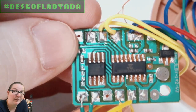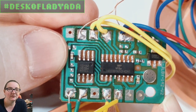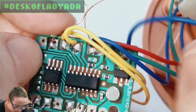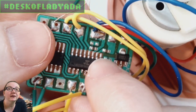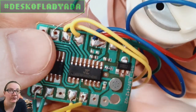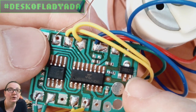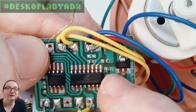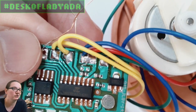Looking at the circuit, there's not a lot going on. For example, there's no regulator - power goes straight in from the battery. There's a little capacitor on the power line but otherwise it powers all the circuitry directly. Save 10 cents - you don't need regulators, just one or two capacitors. This is the motor driver: it doesn't have a built-in motor drive, so there's a transistor - a very simple MOSFET in an SOT-23 package to turn the motor on and off. You don't need an H-bridge because it only spins one direction.